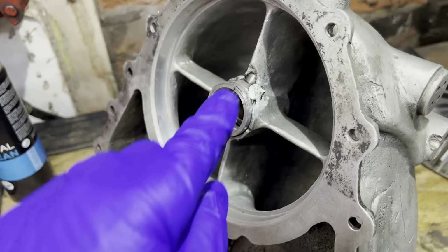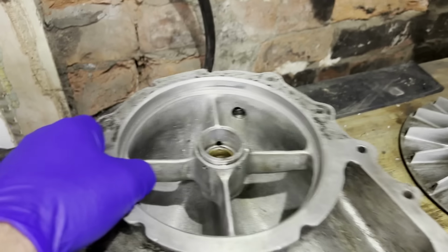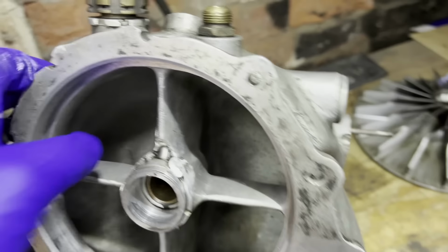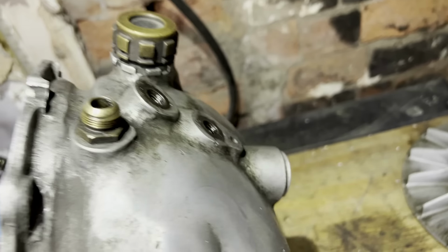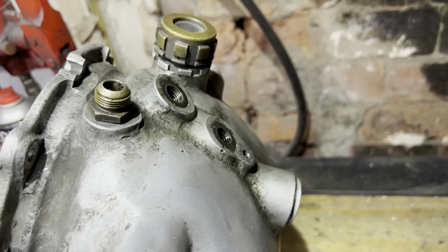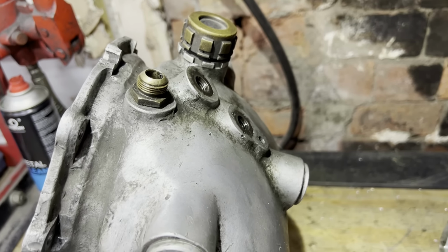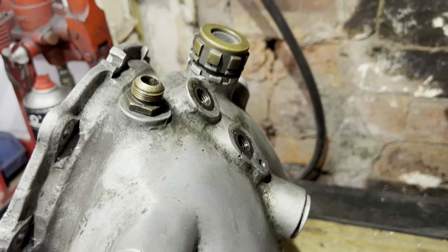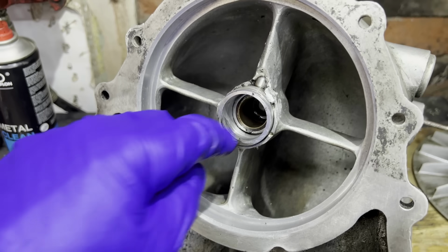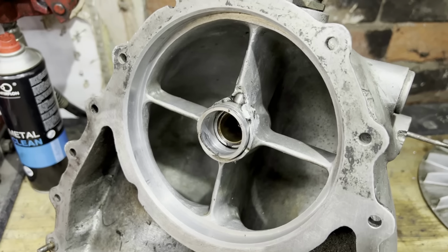And then where this has been damaged and it's been repaired, there's a tube goes up. You can see the hole there in the top of the bore. The tube goes up, comes out of a second fitting on top of here, which goes to a breather, and that just goes to outside the engine cowling. Actually, until it started to use a lot of oil, nothing really ever went up that pipe, because actually what tends to happen is most of the oil will get sucked into this part of the supercharger because there's a vacuum there.